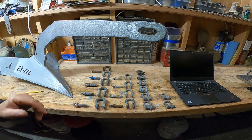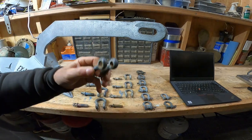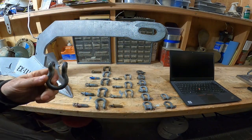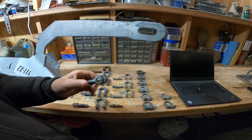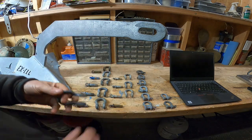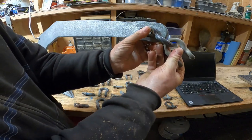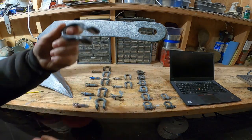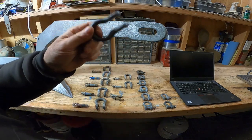A takeaway from this video: if you're anchor shopping and you want to use a particular shackle where the boss passes through, you probably should verify with the manufacturer whether it'll work. If it's a second-hand anchor, put your shackle in your pocket and before you buy it, pass it through. If you're the type of person that doesn't mind using two shackles in this arrangement, then ignore it, because this will pretty much always solve that problem. But I personally prefer a single bow shackle passed through the anchor — that's what I prefer.